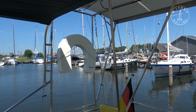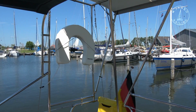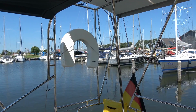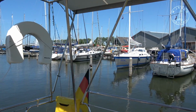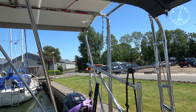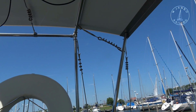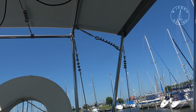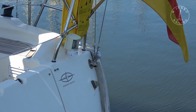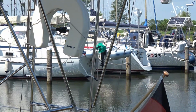It has all been built with 25mm V4A steel pipes with some fittings. The advantage is you can modify your construction as needed with those fittings if changes are necessary. They can take pressure forces very well, but as soon as you pull, they are not very strong, and that's the reason why I put those steel wires in, which can take the pull forces as well.